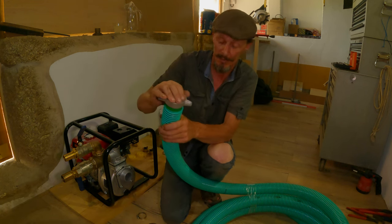This foot valve also has the correct size barb on it — it's actually fractionally larger than the rubber pipe. So we're going to heat it up with a gas torch, and that will soften and stretch the rubber here to the point that we can punch this in and then put the jubilee clip on. That was a bit harder than expected so I stopped filming for a second to beat it on there. With the jubilee clip it's pretty self-explanatory — this part's going underwater so it doesn't necessarily have to go all the way to the end; there's over an inch inside there, and this is basically just to stop it falling off.